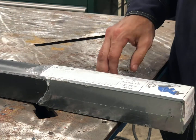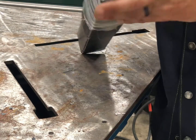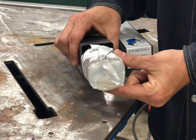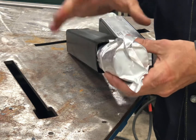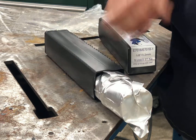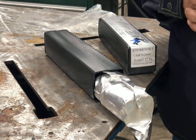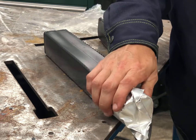This box is the 5 pound box. Once we rip the plastic off, we can open it up and you'll see that it's further sealed. Any low hydrogen rods are sealed to make sure that we don't add any extra moisture, which equals hydrogen, which leads to hydrogen-induced cracking down the road.